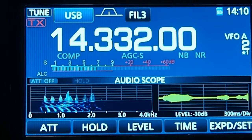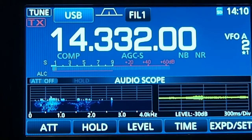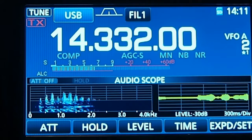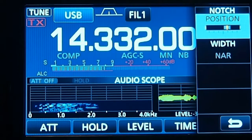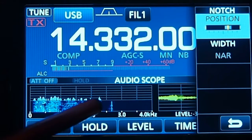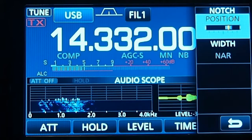So the manual notch filter, or just changing your IF filter width. See if it comes back — it's right in there, there it is. Hit the notch filter again. The automatic notch didn't do a very good job of it, but this seems to do a really good job. You can see it show up right there — and I'm going to move the notch over and just take it out. That works really well. I've got it on narrow.